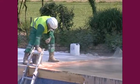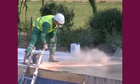The colouring is done on the surface only, meaning you're going to use a pigment hardener that you'll dust onto the surface of the concrete to give it a colour. Artevia Print Integral Colour, mass coloured in the ready mix plant, now means that you can miss out this step if you wish.